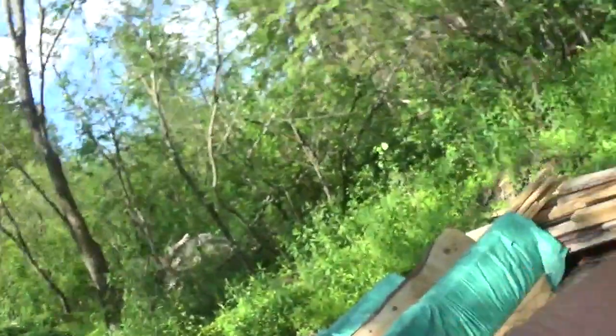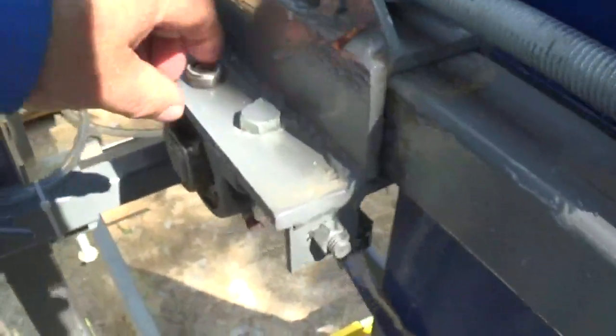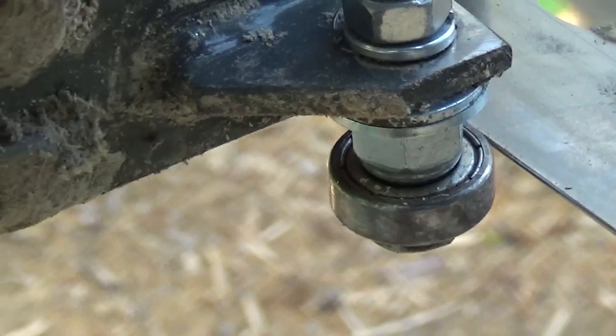Milling is cool. I'm going to finish doing some maintenance on the mill. Let me show you something - the little bearing. I have around 100 hours on the mill. This little bearing cover is damaged, I'm missing a few bearings in there. The one on the other side is still good, but I did grease my big bearings.